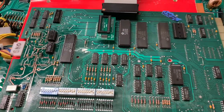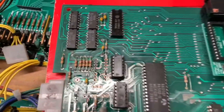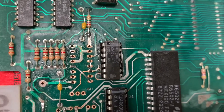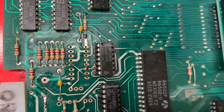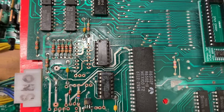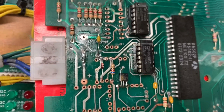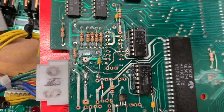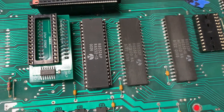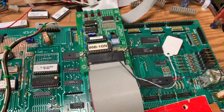The Goldwings MPU - what I found so far was that the socket installed at Z4 had two legs broken off, and that chip is in the reset circuit for the processor. I did a little more cleanup and reinstalled a different reset generator with better connections. I also found that U4, the 6532 RIOT, was failed. So let's boot it with the QuickScan 80.